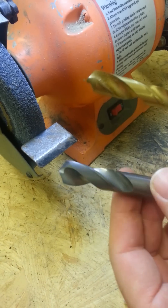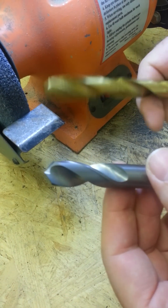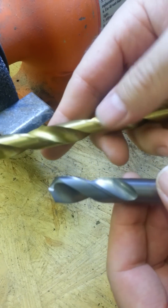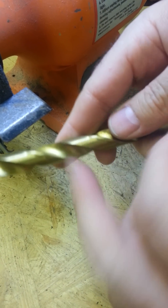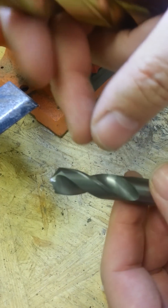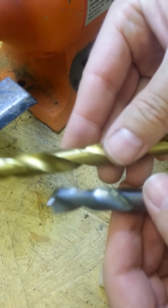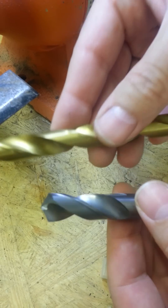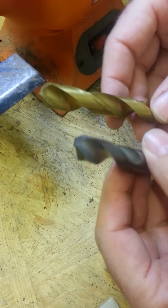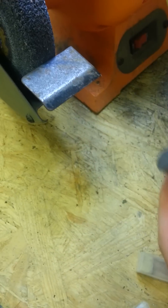This solid carbide bit is truly not solid carbide — there is no such thing as solid carbide. This is a material made out of steel, similar to a high speed drill bit, but they include quite a bit of very fine carbide particles. They're both magnetic, so you can't tell the difference between a carbide bit and a high speed drill bit by using a magnet. Really, the difference is how it responds to a grinding wheel.